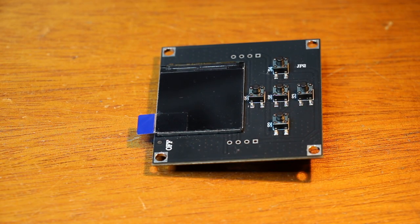I also bought the LMX-2820 controller from AliExpress, and as far as I could see, it works quite well, also having the possibility of emulating a sweeper. The main problem with this programmer is that it works only with a 10 MHz reference, and that's a shame. It should include, for instance, a jumper to work with 100 MHz — a much better reference for this kind of synthesizer.